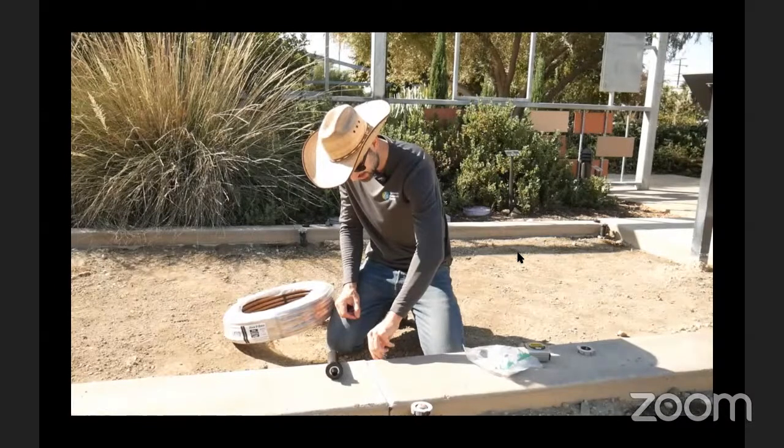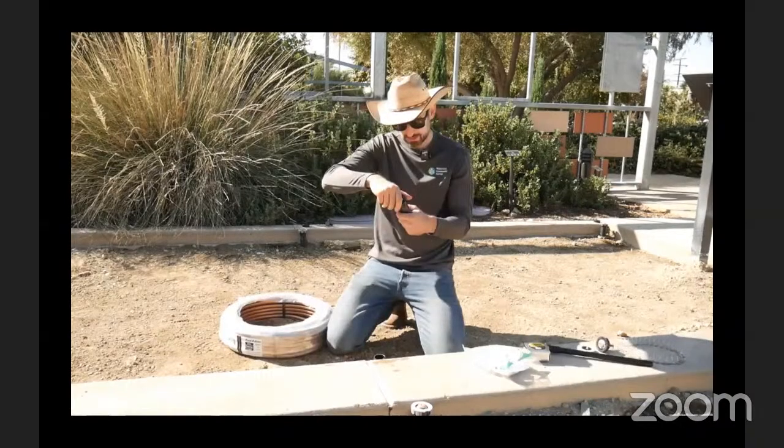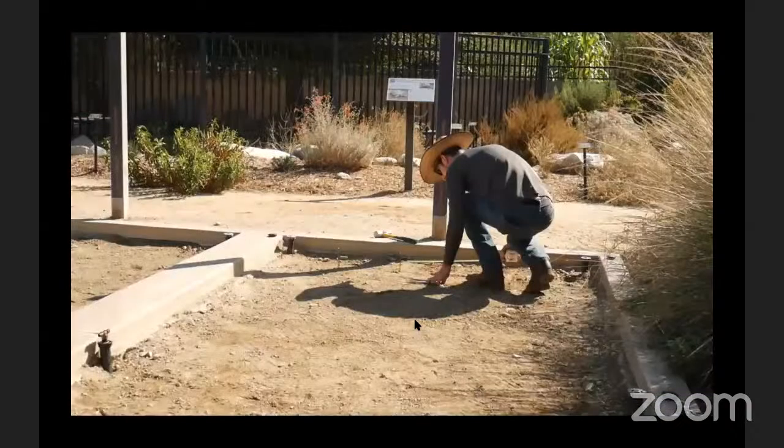And so like we mentioned before, starting by taking the guts out of the sprinkler because it was a Rainbird brand one. If not, you would unscrew it and put the body on, putting in the adapter, a little thread seal tape, and then the adapter on top, and then measuring our spacing down at either end. And so we were doing that typical 18-inch spacing in between our drip lines. And what I like to use, because I always have on hand when I'm putting out drip line a whole bag full of those drip staples, I will also use them as temporary markers to line up my drip. And so this is me measuring.